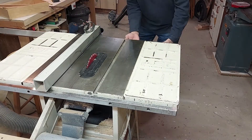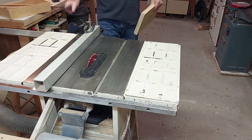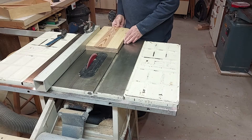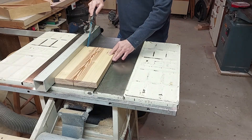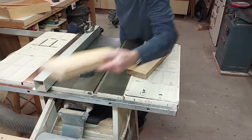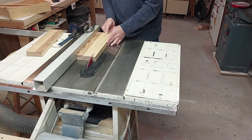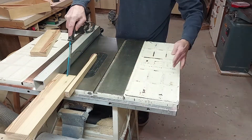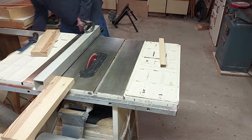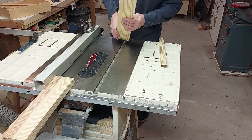So we're going to cut this board pretty much in half, right down the middle of this red section. That's going to eventually give us our two door panels after we cut these in half and so forth. We'll take this one, use the middle section against the fence, then cut off what's left — and those will eventually become our door panels. We'll have to cut them for thickness and all that, but I'm happy with it. They came out about the way I was hoping.